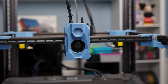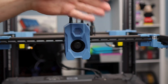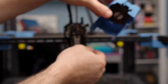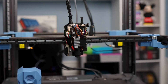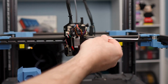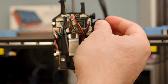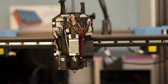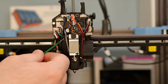Now we're on to the actual removal of our hot end. To do that you have to remove your fan shroud. I suggest disconnecting it so it doesn't fall in the way — it's easy to do. This is magnetically connected, so gently pull it off and be careful because you do have a fan wire there. Bottom right-hand corner, gently disconnect that and set the fan cover aside. Once you have that free, take your 2mm allen key and disconnect the fan on the right side. In my case I had a zip tie there — it's not really in the way but it will hang there, so be mindful when installing the new hot end that you're not pinching any wires.